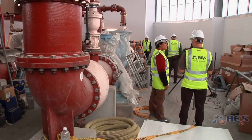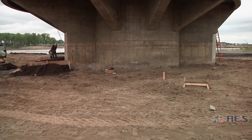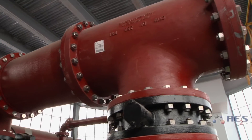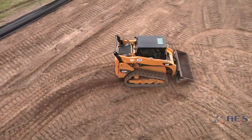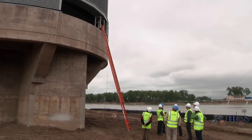Right now we're standing on the operations level for the collector well. There's a total of four pumps going around the center caisson. You're actually standing on the hatch going down — if you open that up, the water level will be about what the river level's at, so you'd have probably a 20-foot drop to water, and then that extends another probably 80 feet to the bottom of the plug. The heart of it is the caisson, which you bring water up through the pumps. Everything gets manifolded together and there's a large cross right in front of you, so all the water gets pumped into that cross and then it goes down through a chase into the ground and out into the transmission line back to the water plant.